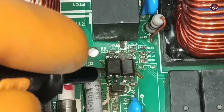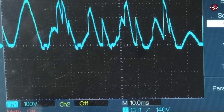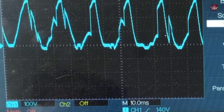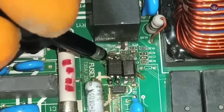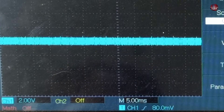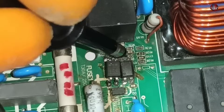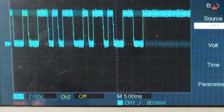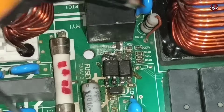Now let's check how many voltages we get. The signals have now changed and are fluctuating — 140 volts are passing through the collector. Now checking the input coming from the microcontroller: pressing the auto button on the oscilloscope, the input from the microcontroller to the optocoupler input is fine now and signals are generated on the oscilloscope screen. Checking the other optocoupler — the voltages and signals are now generated fine over here too, with pulses moving on the oscilloscope screen. This means the motherboard has been fixed.